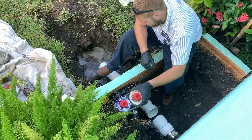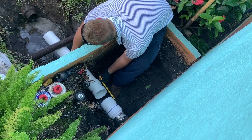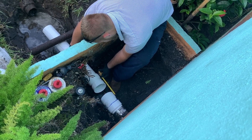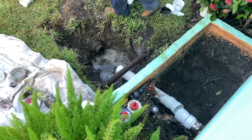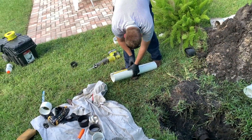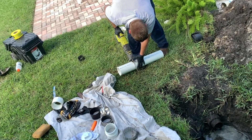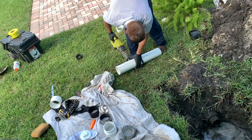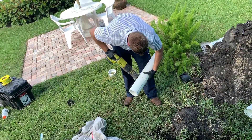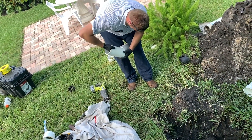Learning plumbing here at Delray Beach, Casa Del Mar on Cazarena Street. The little piece going between those two elbows — that's what we're doing. It looks like we're getting about seven or eight inches. He's got to keep track of the other side too because he's got to put that one joint on. We're going to mark it, saw it with the sawzall, and then brush all the little pieces off to get a nice clean edge.